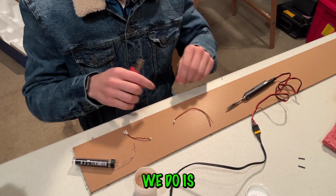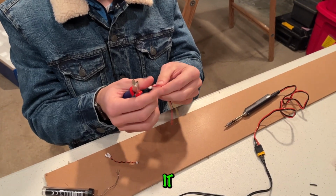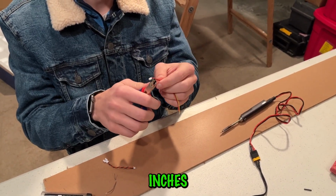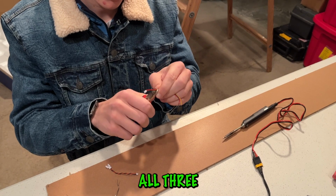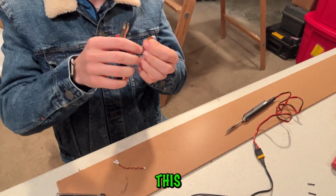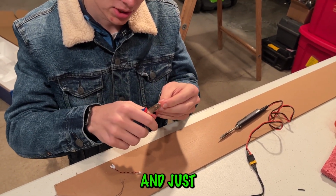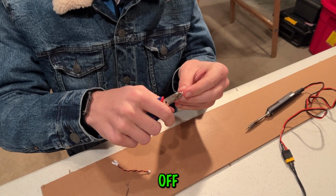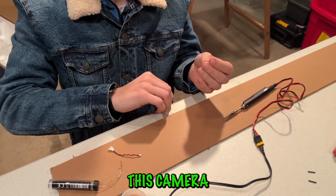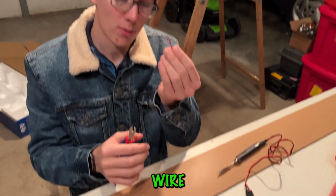All right, so first thing we're gonna do is take our 3-pin connector, again linked in the description, and we're gonna cut it maybe 1.5 inches, 2 inches up, and we're gonna cut all 3 wires. Which reminds me, we don't need this yellow wire. So I'm just gonna go down near the base and just snip it off. We don't need it. We will never need it for this camera. So now we're down to just the red and the black wire.